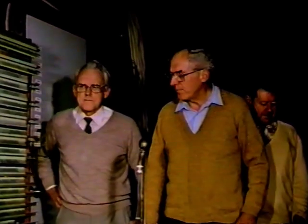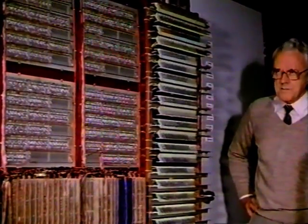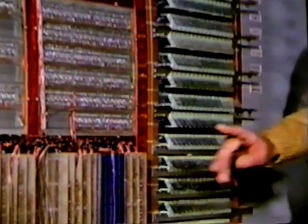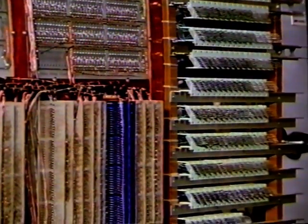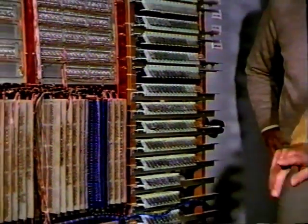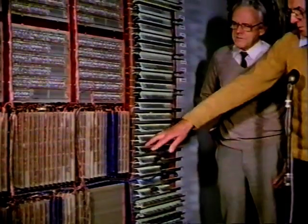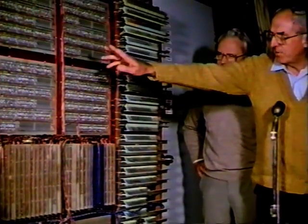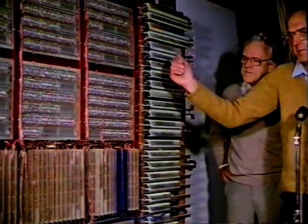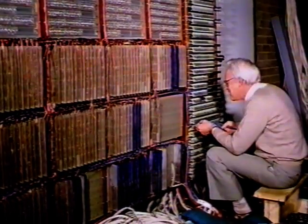Thank you. Well, this is a solid-state relay that we've been working on for quite a few years now. It replaces the old electro-pneumatic relay and switch action. Each of these small boards here represents one stop on the organ. Each row represents a keyboard, like that's the great, the accompaniment, the solo and the pedal. And these red looms here are the outputs of the stop section, which couples up to the driver transistors, which then drive the notes on the pipes.